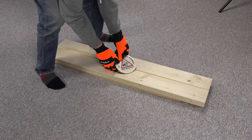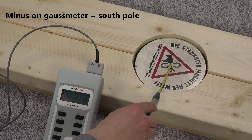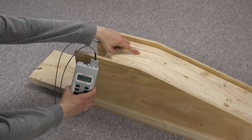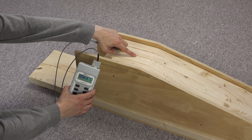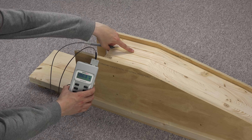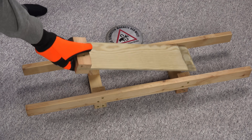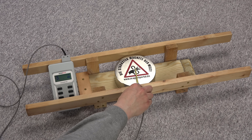The first magnet is placed with its south pole facing upwards, and the heavy wedge is placed over the magnet. I double-checked the polarity and noticed a low gauss reading above the wedge — 25 centimeters or 10 inches from the magnet — it is only 1% of the gauss reading flat at the surface. Nicely low for safety. I still secured the wedge with some old belts to make sure the bottom magnet isn't suddenly set free. The other magnet is placed in a carrier to make sure we never have our fingers between the magnets, again with the south pole upwards.